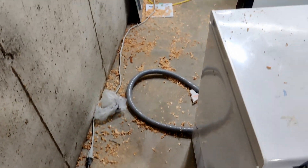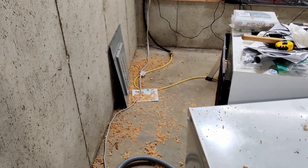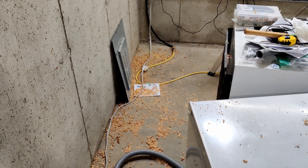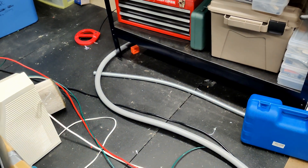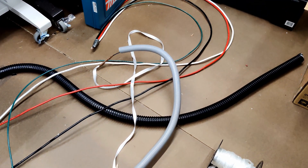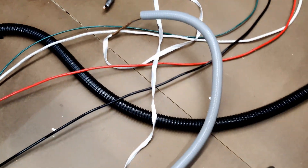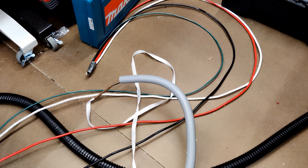If you're wondering if that sucked, it very much did. It's basically like standing at the exhaust port of a sawmill and putting your face up against it. This is one reason I regret trying to use liquid tight for this application — there is simply so much friction in this length of liquid tight that even getting the pull tape through the conduit was difficult. I think I'm going to use some lubricant and mule tape to try to pull the wires through this conduit.